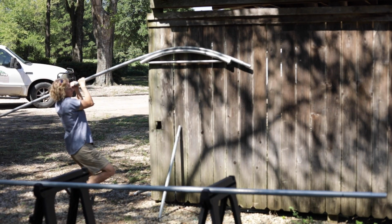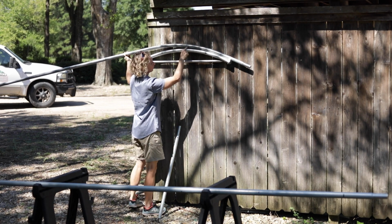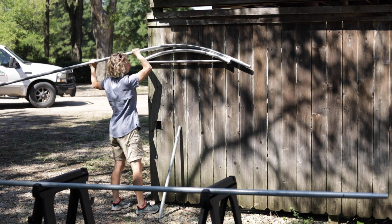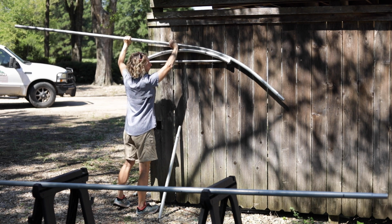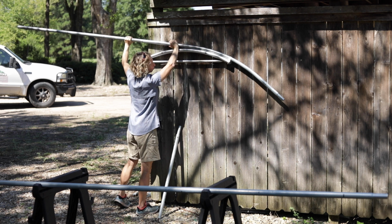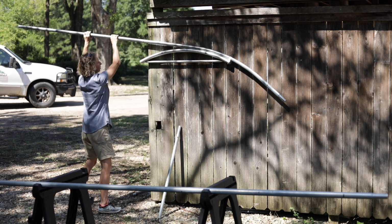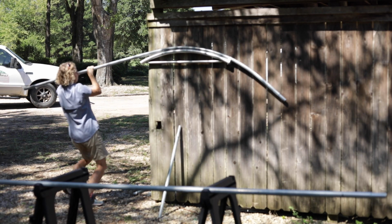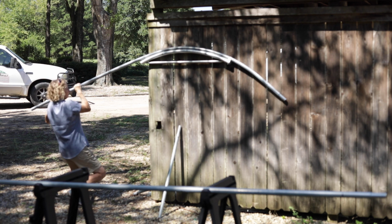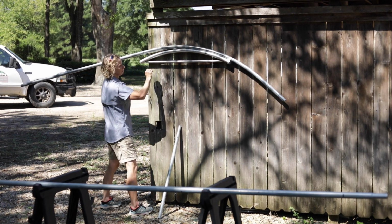And you can create a hoop with it by bending multiple sections. It is a mild steel and it's flexible and it's rigid, being that it's a larger diameter tube than conduit. It's going to have substantial holding capacity versus a half-inch or three-quarter-inch piece of EMT. And again, that EMT, I want to super stress what you said a minute ago about the composition. Having more lead, being softer, it's a hell of a difference than 100% steel.